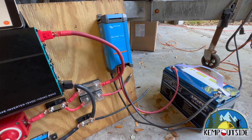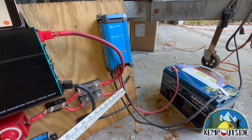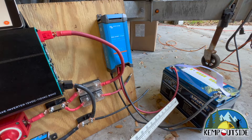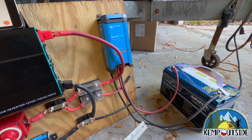To use this as a standalone piece of equipment, I first had to unhook it from my system. These are screwed in with ferrules on the ends, terminated with ferrules. So I made a second set of 6-gauge wire that runs to the battery, and I'm going to charge this battery up because it's brand new. You always want to charge each battery individually — even if you're going to do a battery bank with multiple batteries, charge each one individually. I've already charged up the first battery, designed my system over here on the left, and once I figured out my proof of concept, I went ahead and ordered the second battery.